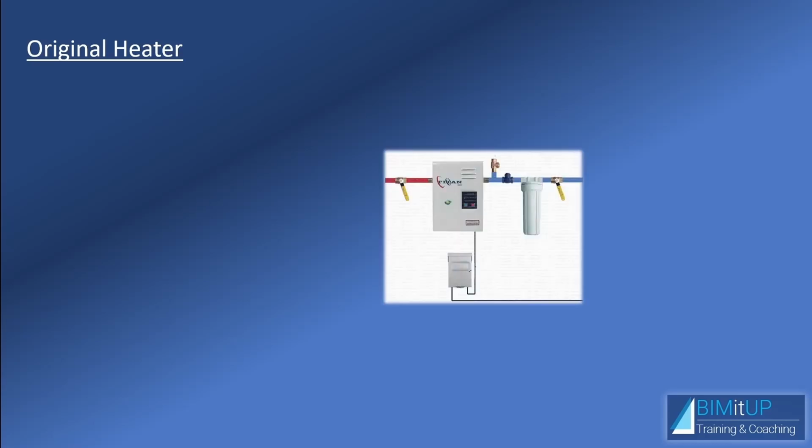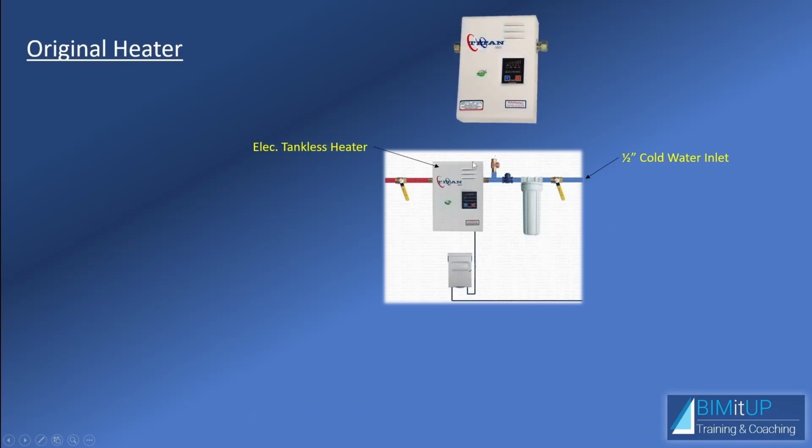So let's talk about the original water heater and a typical water heater installation. In a typical water heater installation, you have your cold water inlet right here. You have your electric tankless water heater, which in this case is this Titan. Then you have the hot water outlet to the hot water system. You also want isolation valves. Ideally, you would like to have one at the inlet and one at the outlet.